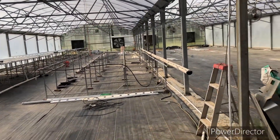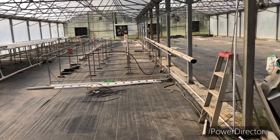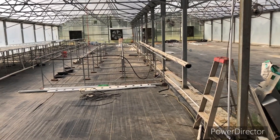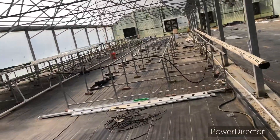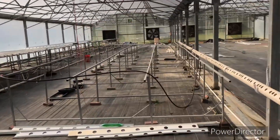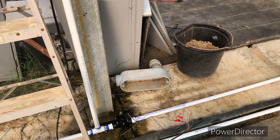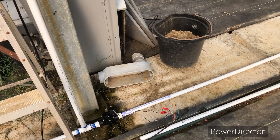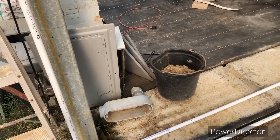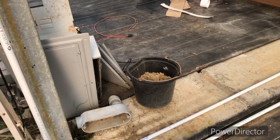We've got a little thermometer down there and it looks like we're sitting right at about 85 degrees. If all of this was shut off, it'd be 110 to 115 degrees in here today, even though it's only about an 80-degree day outside. If it's sunny, it doesn't take long and this thing really heats up. That's how we've done it, and hopefully you can leverage the information if you have an applicable need. It's just the way we solved automating our wet wall system — from pumping the water to refilling it to turning the system on and off.